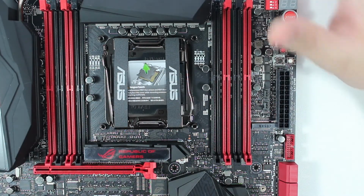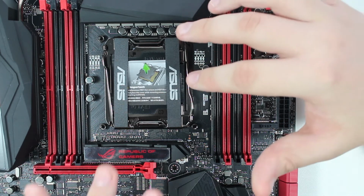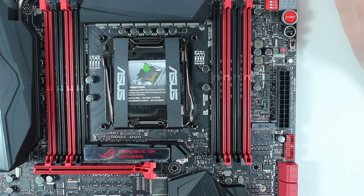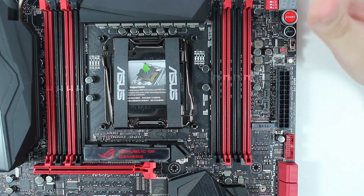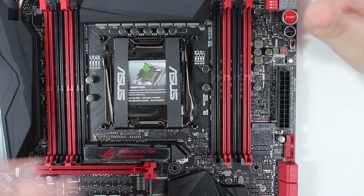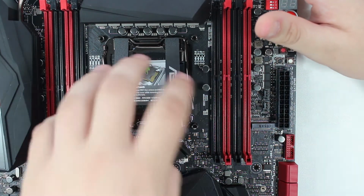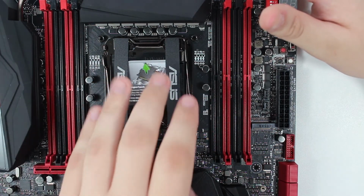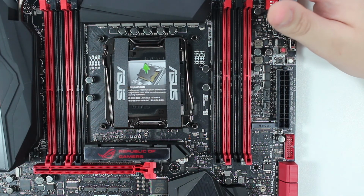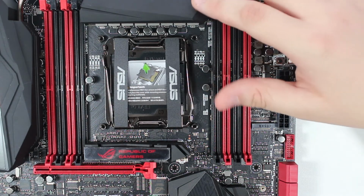We don't know what they're going to be in the future, if they're going to be re-added with another upgrade or something, but the pins are on the CPUs themselves. So with the added extra pins and usage, Asus basically gets better overclocking, better power stability. We're not sure why Intel disabled them, and I don't know if it'll affect warranty statuses with overclocking, but typically Intel don't cover warranty if you overclock and fry your CPU. They do have their performance tuning extra warranty that you can buy, and it might affect that with the extra pins, because it's literally only Asus boards that have these extra pins. No other board from MSI, Gigabyte, ASRock or EVGA will have them, just Asus. So it'll be interesting to find out what advantages they add over standard boards, and if they do in fact provide extra overclocking ability.